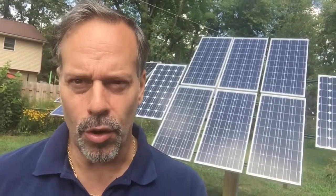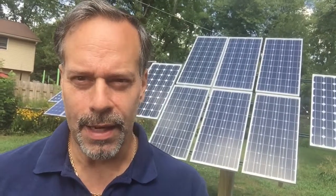This is my first-generation mounting system. It was important for me to be able to twist the panels all the way east, all the way west, and throughout the day. That's the first thing I do when I get out in the morning. If I'm not going to be home — on vacation or anything like that — I'll mount them at high noon to capture a little bit. I've been able to generate a huge amount of additional power by being able to swivel them, as opposed to permanent mounts facing direct south at a fixed angle depending on the time of year.